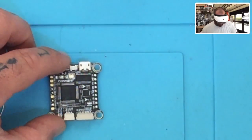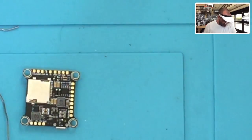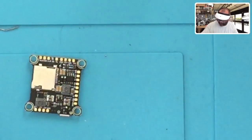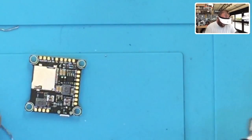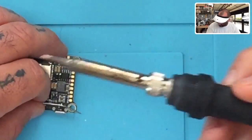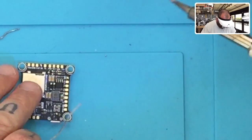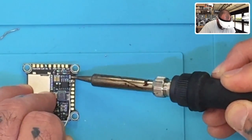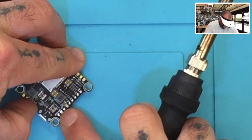I'm going to do the same thing again on the other side. Let me take the pen again and just run it across. Now — if you use flux pens and you don't shake them before use, the flux will start to separate; the materials inside will start to separate. You've got to shake it up because you need it all to combine properly before you apply it. So here goes — I'll run the iron straight across just like that. Look at that — all the solder is exactly where it's supposed to be, none of it bridged together and none of it ran outside the circles.